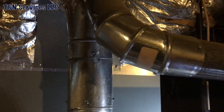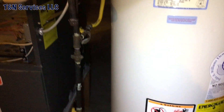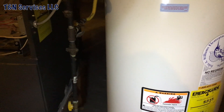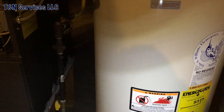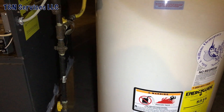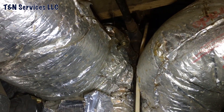If you look up there, that's a half-inch gas line running down feeding a 90,000 BTU furnace and a 36,000 BTU water heater. At 10 feet we're supposed to carry about 120,000 to 130,000 BTUs, so we're off by about 6,000 BTUs as far as what it'll carry.